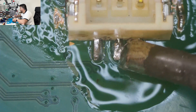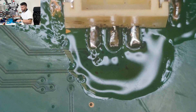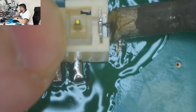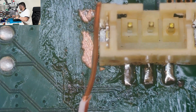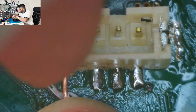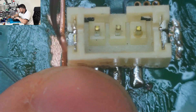I'm putting a little extra solder so it can have a more secure connection. The durability of this is compromised, so if you plug in the fan and try to take it out you'll just tear it again. What I'm doing is creating a form of reinforced connection here — I'm going to connect this leg to here with some wire. I'll solder this wire down here, and then this part will go into the connector on the side where the solder pin is, and we'll solder it right there.